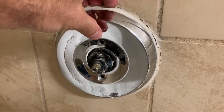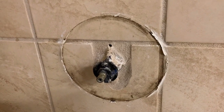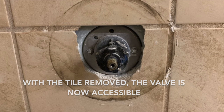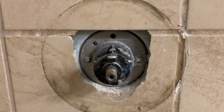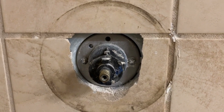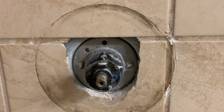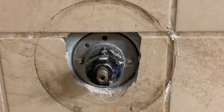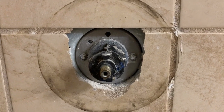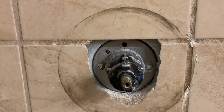With the two screws off we'll just pull this off — you may need a blade to cut the caulking to make that a little easier. So I had a little minor setback: the tile installer who put this tile in years ago covered up the screws that allow you to remove the valve internals. I'm sure he had no intention of returning to this job, so he just did things that were easy for him when it came to cutting the tile. But I've chiseled it away and we're ready to start disassembling.